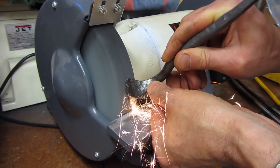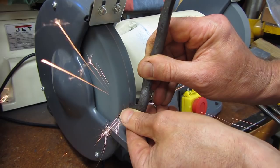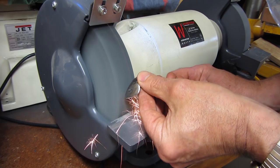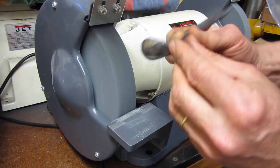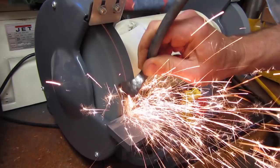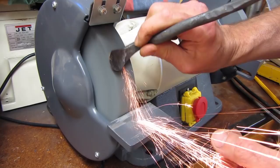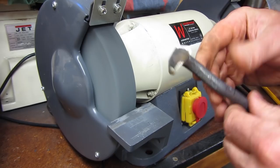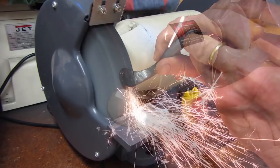I'm trying to get a nice curve around the front edge — that's the sort of thing I want. A fairly important thing here is to keep it moving so you get a nice smooth piece of metal and get rid of all the hammer marks. It's pretty close to where I want to be, and I've got it quite nicely shaped all around.